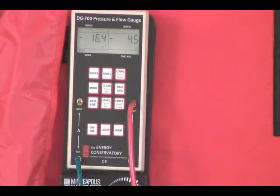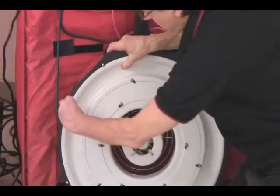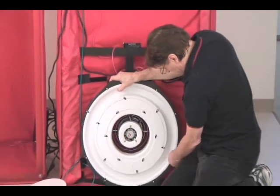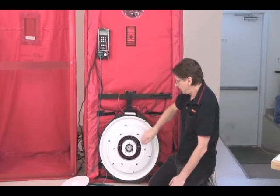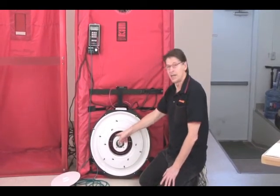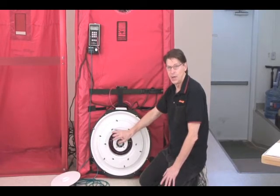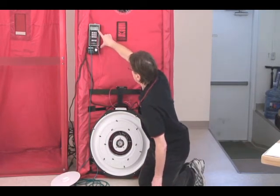What we're going to do is put a big restrictor plate on here because it makes it a bit easier to understand, and clip some of these clips to hold it in place. So behind this plate we have a negative pressure — the greater the negative pressure created by the fan, the more air that flows through it. Right now the negative pressure here is minus 17.